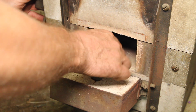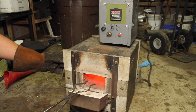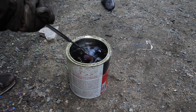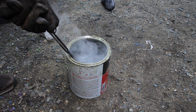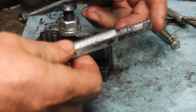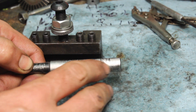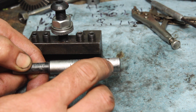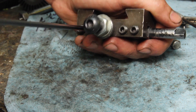Let's cook this thing. I tempered this at 375°F in the oven, cleaned it up a little bit, and stoned the important edges. Before I hardened it I had scribed on there with the Dremel '10 TPI right hand.' If I did something underneath here, that would be a sub-scribble. Putting it in a boring bar holder.